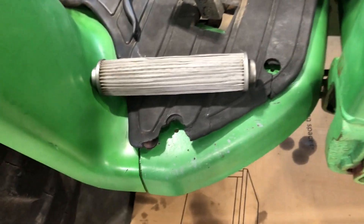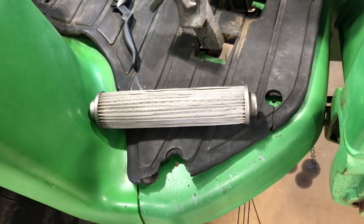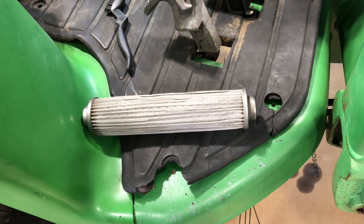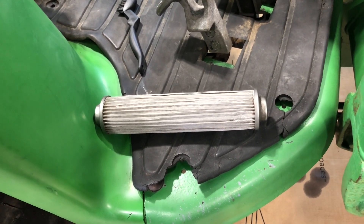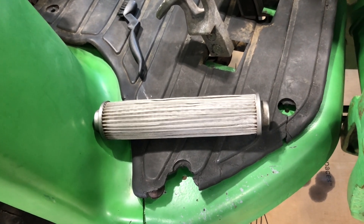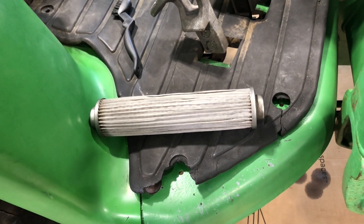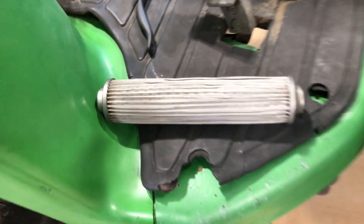When you do this, you've got to drop all the fluid from the transmission area, since the hydraulic suction pulls fluid from there. About five gallons will come right out. This is a good time to look at the fluid — if it's cloudy or milky, you want to change all the fluid in the machine, doing an entire fluid change. Clean out your screen and if it's fine, put it all back together.